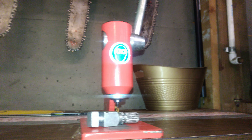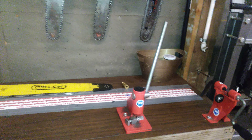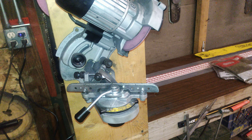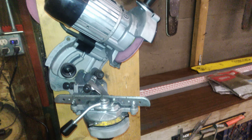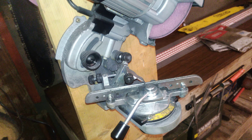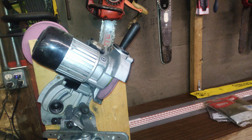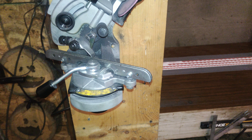The only thing I would say is if you do get a breaker, get a new punch right away and have a couple of them on hand. They do break. When they do, all you got to do is crank this guy down a little bit — there's an Allen right there that you loosen up and slide the new punch in. They aren't very expensive. I've broken a few of them, it's not the end of the world. If you break one and have one on hand, just pop it in and order another one. That's not the brand's fault — every one of them is going to do that. I think there's an Oregon punch in there right now.